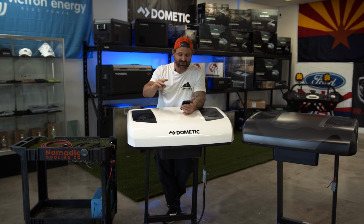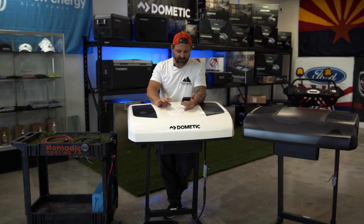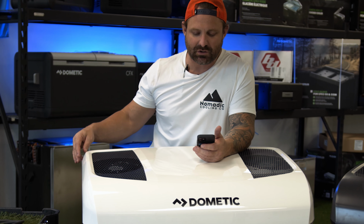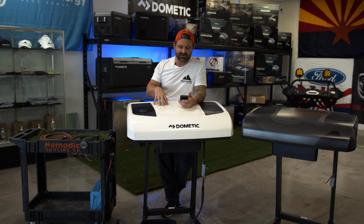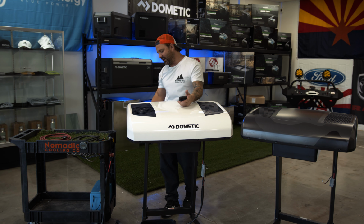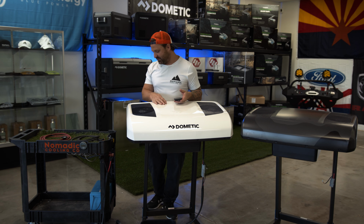The air conditioner just shut off at 5:20. Had to run over here, get it going. Basically, guys, the battery is still showing almost full at 12.74 volts. The air conditioner shut off based on low voltage because of the voltage drop between the battery and the unit, which is probably due to how long the cable is. And also, this thing needs to be running.